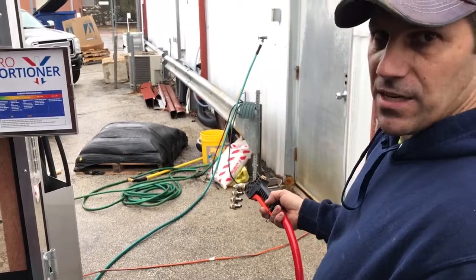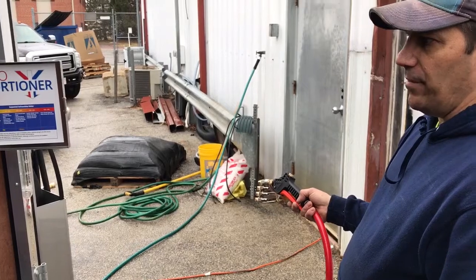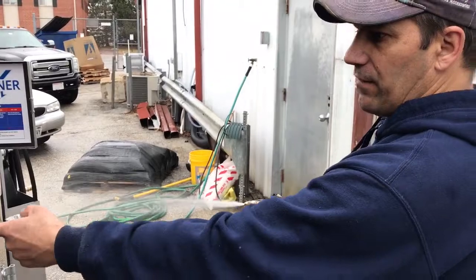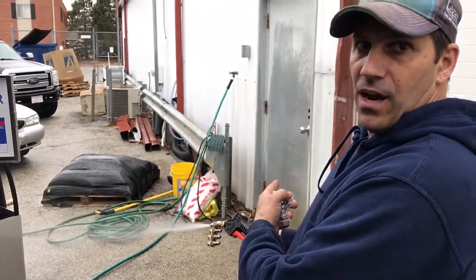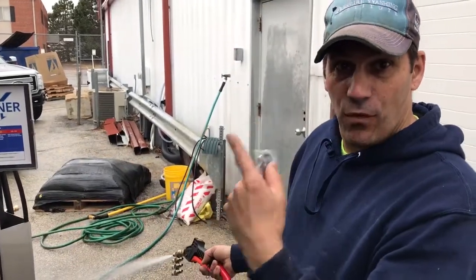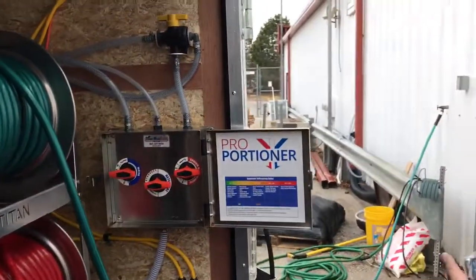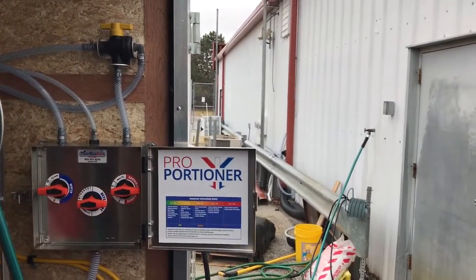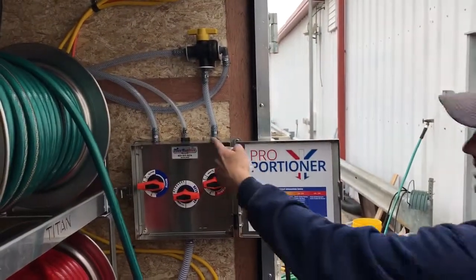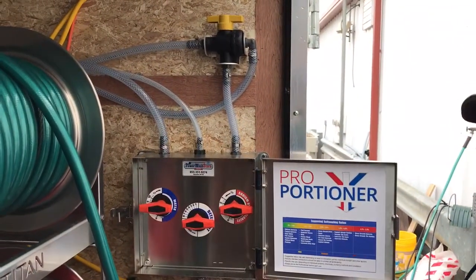It takes a couple of seconds — here we go. Now what we've done is we've forced all the air from the booster pump all the way to the end of the gun out of the system. Now I'm going to hit the A button, which is going to stop force feeding the booster pump, and you'll see the water actually beginning to get sucked into the line. Now I may have to do this 2, 3, 4 times initially to get the water all the way through the system. I'm going to hit the A button and watch the line here — and there you go, you see the water get sucked in right away.